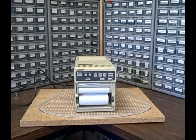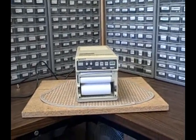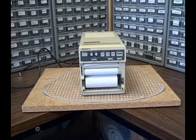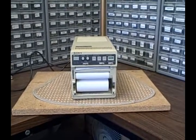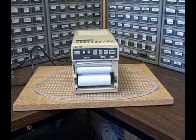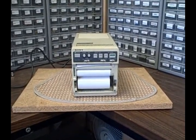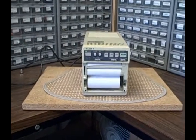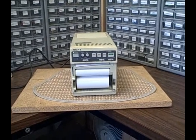It was originally made for ultrasounds, to print the ultrasound results, and it has a positive and negative mode. I've got it in positive right now. We're going to run a test on it to see if we can get an image to print. I'm going to connect it up to a standard video camera with an RCA connector modified with a jack that goes to a BNC, and we're going to see if we can capture the image.